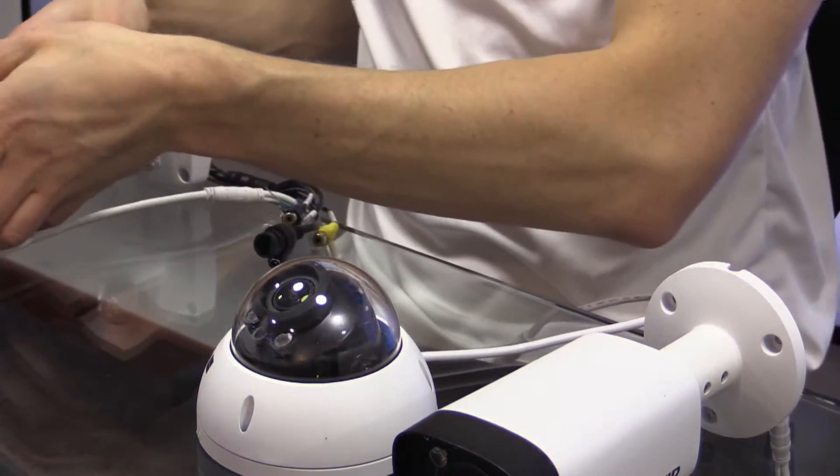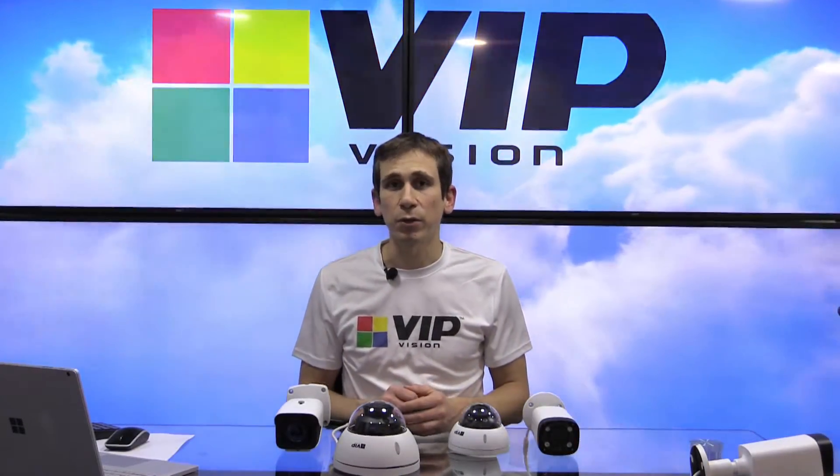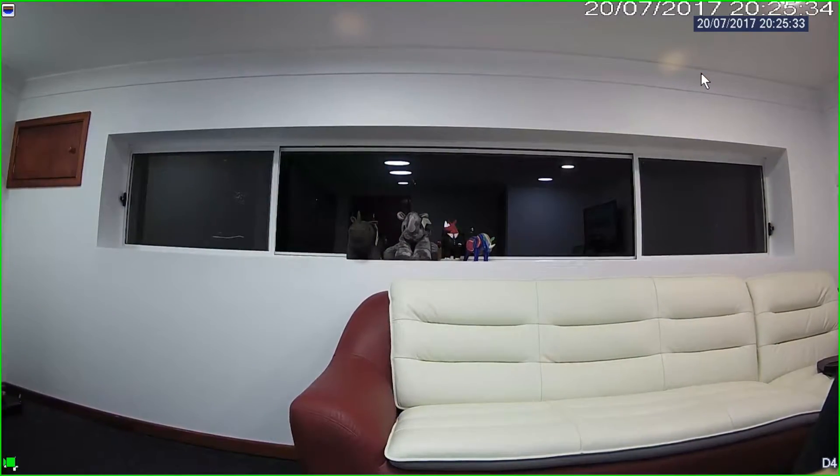In this video I actually want to show you using the network video recorder how to zoom in and out. I've got another camera set up here so I'll switch across to that now. This is a motorized 4 megapixel vari-focal dome camera. It's set up and currently in its widest position and it is focused because it's been autofocused. Note that once you've mounted your camera it may not be focused depending on the state that it left the factory and how you've mounted it, but that's no problem because we're going to autofocus it anyway.